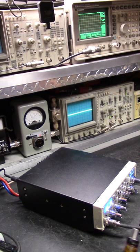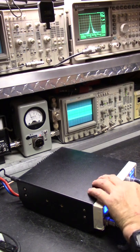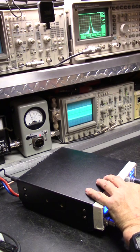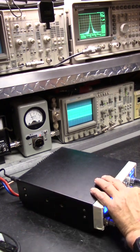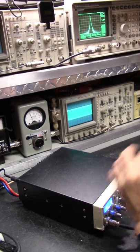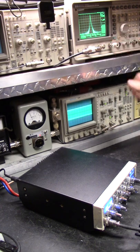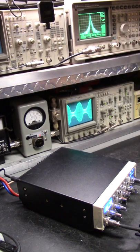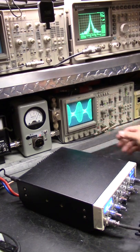Let's take a look at some distortion. Let's power halfway. Well, I'm not going to run this wide open the whole time on this video. It's just too much. Wide open right there is a 125. It's too much for this radio. All right, so now, at one channel wide, one channel block. Yeah, it's not bad, right? It doesn't look bad. The wave is disgusting. And even with the volts I'm pumping into it, it won't achieve 100% modulation.